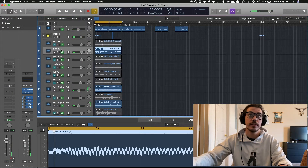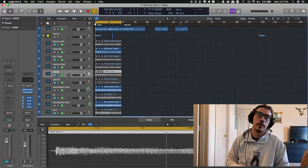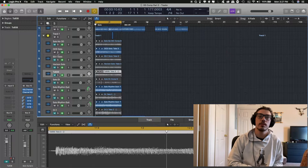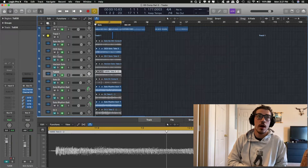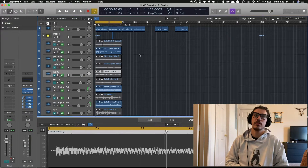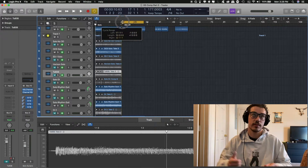The OCD does sound a lot darker based off its Bode plot, and a lot boxier since it's cutting off more of the highs than the other three. When you compare the four, the TS-808 might be a good fit in this situation, with the SD-1 being close depending on preference. The TS-808 just doesn't remove too much bass, so it doesn't sound too bright on leads. The OCD, though, is noticeably making it sound more boxy and darker.